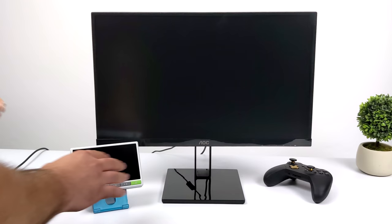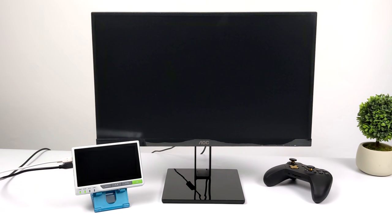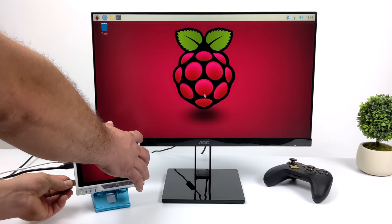There's one more feature I wanted to test and that was the HDMI out. Unfortunately you can't just hot-plug HDMI — you do have to reboot the unit — but that micro HDMI port works really well. I've got it connected to a simple AOC monitor over micro HDMI to full-size HDMI and it mirrors the screen on the ReTerminal. We can still use the touch screen on the terminal itself, or just plug in a mouse and keyboard and use this as a desktop PC. With a battery module added, this would be a cool little carry-around Linux machine.